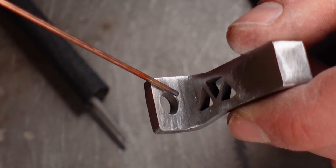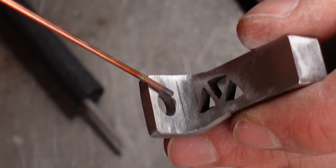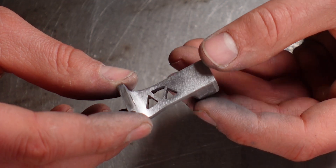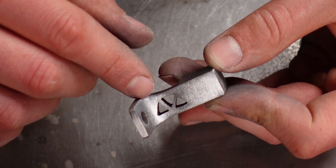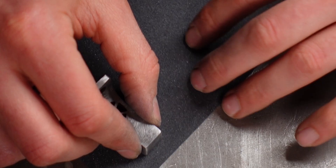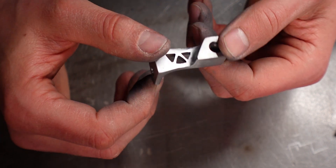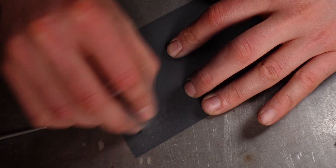These round parts are the worst — I have these two lines in there that are so hard to get out because filing in here takes ages. But it's these little details that make all the difference. After the 180-grit sanding paper, you can still see the scratches on the surface, but I got all of the little dents and marks out so it already has a very even surface all around. Next up: 320 grit — already a much smoother surface. I think I'll go one more and then that should be it, because my fingers are completely destroyed.